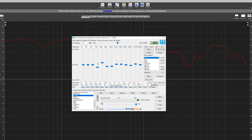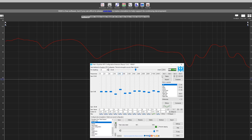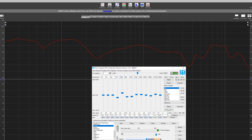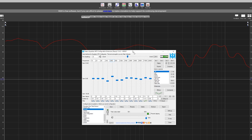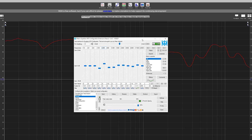The other major issue I have is the dip that's around 300 Hz, which is what causes it to sound a little bit hollow for certain tracks. So I boost this by about 4 dB. My feeling is that the dip exists as a result of closing off the headphone with the concave glass — that's just where they had to deal with whatever resonances would have showed up. I don't know if that's actually what's going on, but in any case it does kind of ruin the frequency response. You could elevate this by quite a bit more, but I don't want to risk introducing any unwanted qualities. I'd rather err on the side of caution than try to get it to measure flat. But I do think adding a little bit of energy there still helps find the balance.